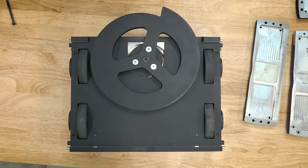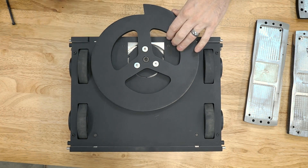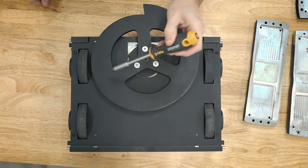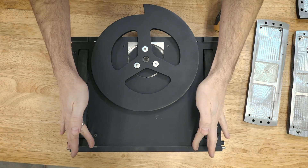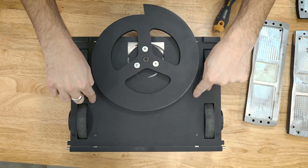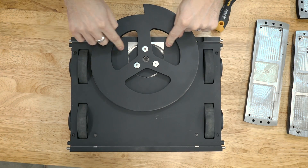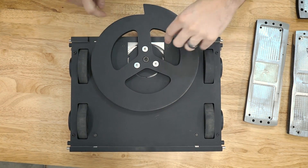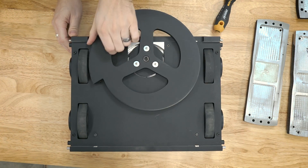On the last armor, the blade came into contact with the edge of the armor, ripping it out and bending it. So on this version I've installed screw holes here and elsewhere under the weapon, tapped directly into the weapon block rather than into the frame rails. The problem before was that if a screw broke off inside the frame it was a real pain to remove. Now with threaded inserts going directly into the block, if they shear off I can just remove the insert, put a new one in, and I'm good to go. That's a bit more robust.